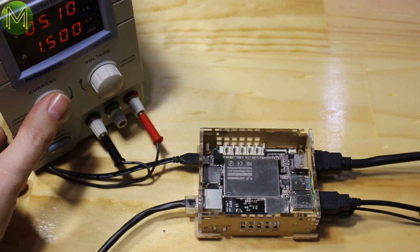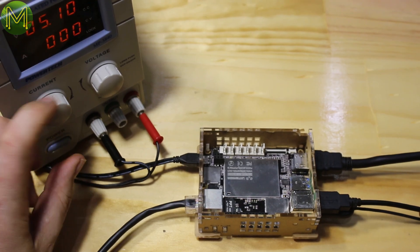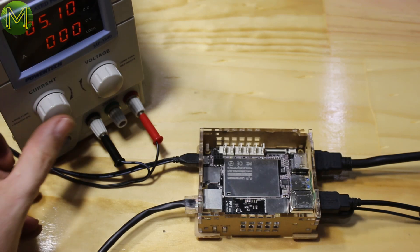So then let's try 1.5 amps. It seemed to start well, but wouldn't even get past first base and kept shutting off. So it would seem that 2 amps is the absolute minimum to boot up, but once the USB buses are loaded, it would probably shut down. I would stick with a 3 amp supply to be sure.